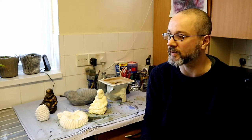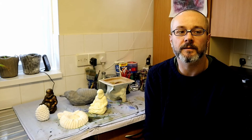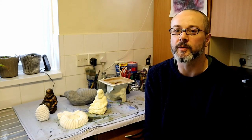Now we come on to cracks in your plaster. This is something I don't experience very often, but if you do get cracks you're probably mixing the plaster wrong — you're probably putting too much water in with your plaster. So avoid that, and as I say, look at your directions and make sure you're getting the ratios right.